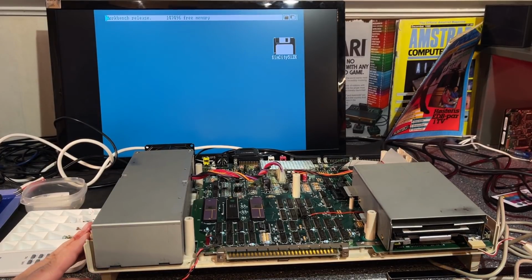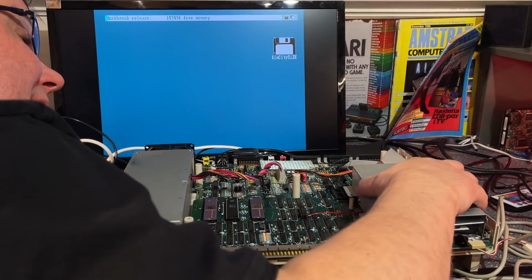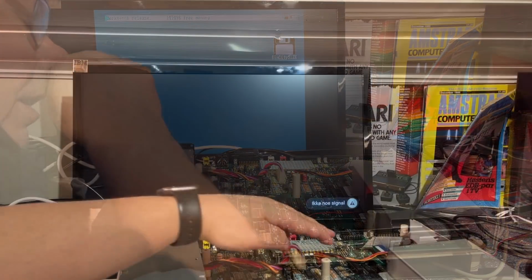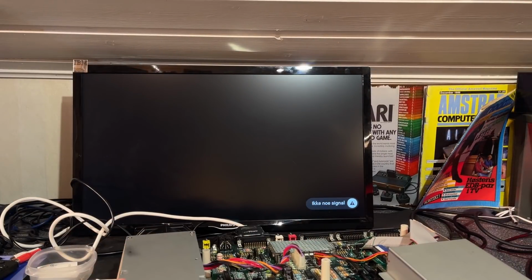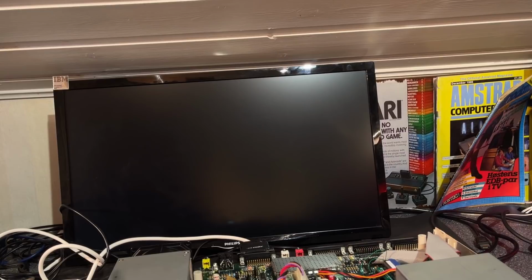That is so nice. I'm really happy now that this worked out to be okay. However, the floppy disk drive is still a little bit in conflict. I inserted 3.1 ROM and I'm testing it now. Let's see. No, that didn't work. Maybe that ROM is not possible to use on Amiga 1000. No, it just shows a red screen, so obviously this ROM cannot be used, and what I'm thinking is because that is not a compatible chip.